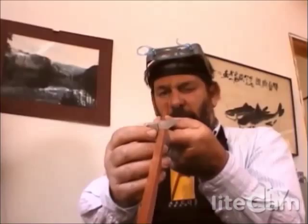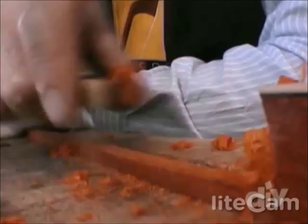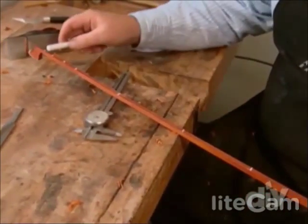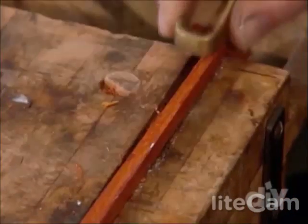What's needed is a logarithmic progression. That progression means Stephen will mark changes in thickness along the stick. He makes adjustments with a hand plane and checks constantly on his progress. He wants to take a little more material off so that from one graduation to the next they get progressively greater, giving a nice even taper — then go back in and take a couple more plane passes.